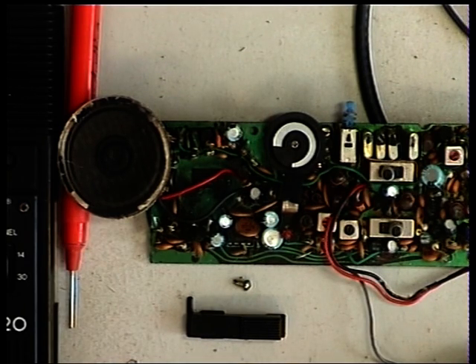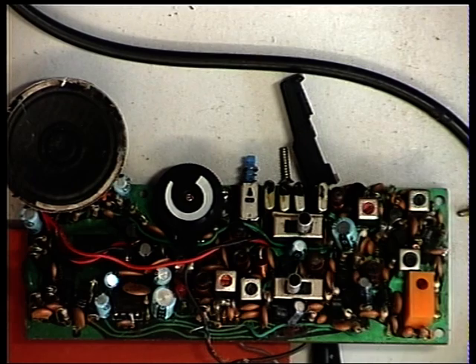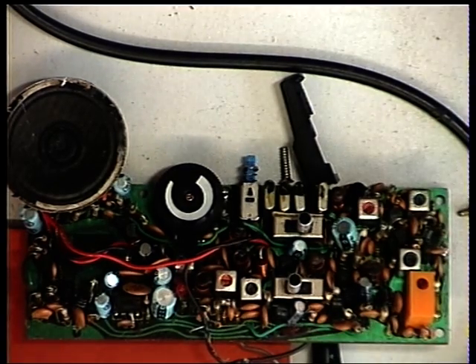What we're going to do is hook it up to test equipment, which is quite a pain on these kinds of equipment because there are no sockets, so all the test equipment leads have to be unsoldered in. We also need nine volts at 40 to 50 milliamps. Once the test equipment is set up, you'll appreciate these radios are absolutely cost-prohibitive to service - I'd say they cost twice as much to service as a normal mobile set, which would bring them above their original price.